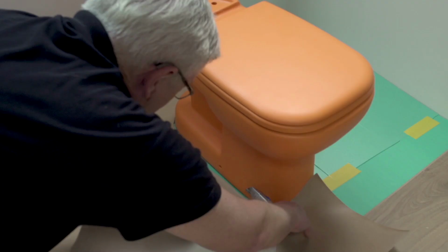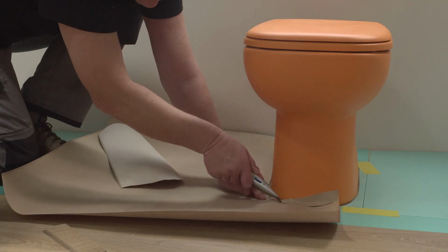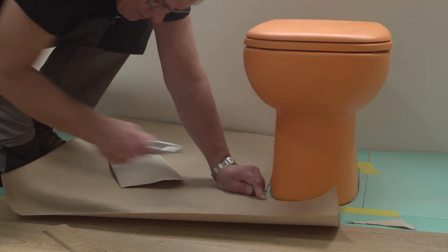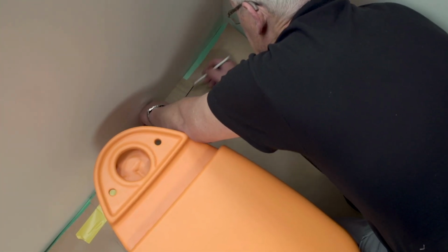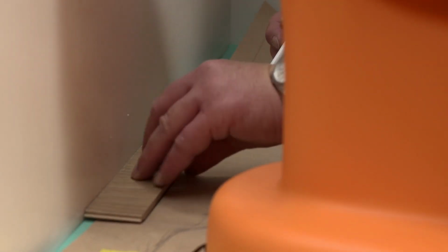You will draw the shape of the round object on it, so that you can use it later on the boards as a pattern. Ensure that the paper fits around the pillar and use tape to keep everything in place. Also indicate the distance from the round shape to the lastly placed row of boards on the paper.